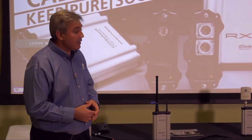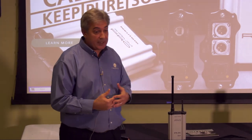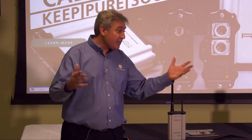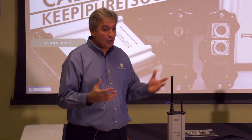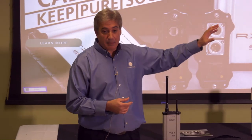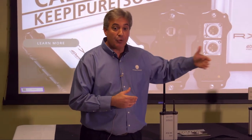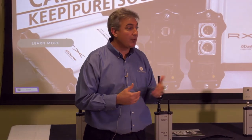Imagine if we had to leave the room we're in right now. The signal gets reflected by gypsum board and glass, and absorbed by water. If this room were full of people, we'd have more signal absorption from the SHF frequencies we're transmitting at. In that case, I can take my repeater and put it outside the obstruction — the wall or the door — and retransmit that signal. Turn up the power and retransmit out to any of the receivers in range.